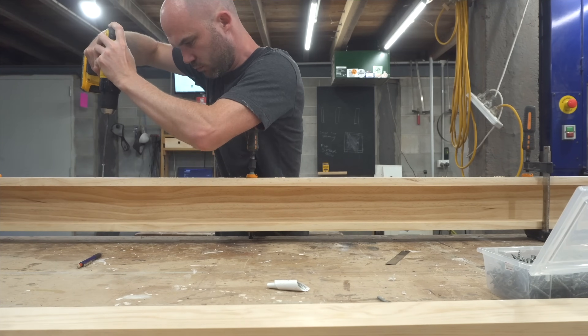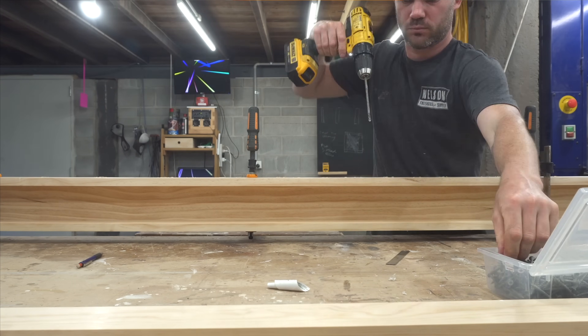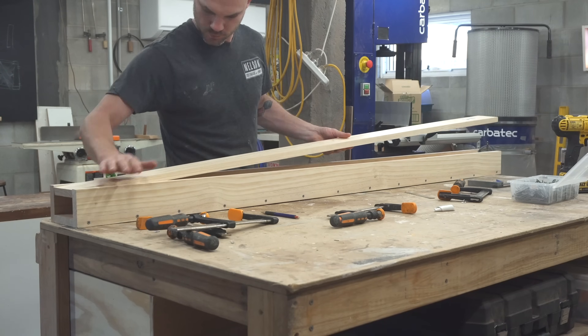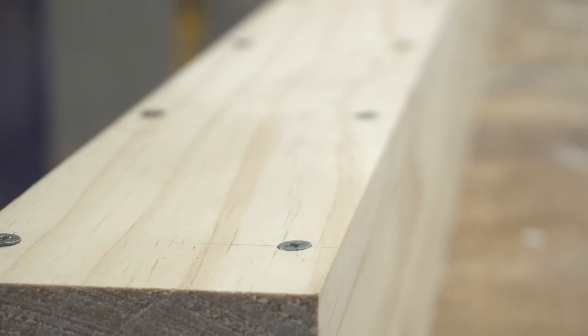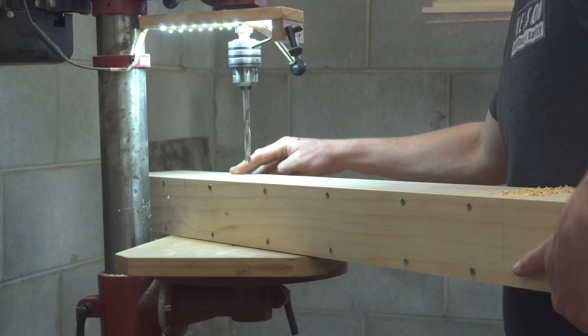The reason I've put in so many screws along this length is that as I fill this with steam, the box is going to want to warp and twist like crazy, and then the steam's going to escape and you won't get the temperature you want. You may be thinking plywood would have been the better option, and I think it would have, but I had this pine left over from another project. While solid wood isn't ideal, all it needs is to hold pressure. Another popular option according to YouTube is PVC.